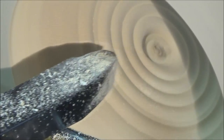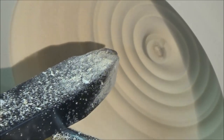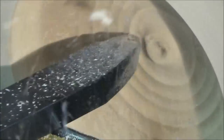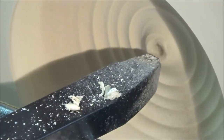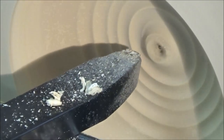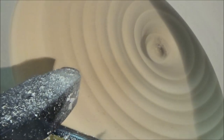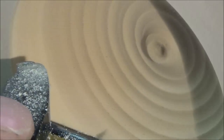Watch: when the cutter stops cutting and the wood hits the bar, it stops cutting. It's very difficult to catch. If that was a scraper it would just self-feed and you'd get an almighty catch. Let's clean that up — let me show you the surface.